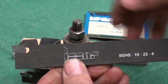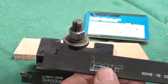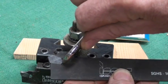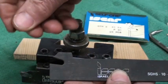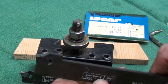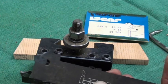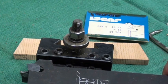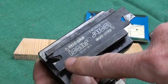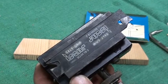This is a different size than the one I was just showing you — I don't have a holder for this, it's just an oddball I've got. When you buy these they come with a little extractor tool; you put it in there, turn it, and it pops out. When you put them in, they're really self-tightening — just get it started and I like to tap it gently with a piece of wood. The more you use it the tighter it gets. This end broke off on me once so it's ruined. Notice it says 'self grip' on there.